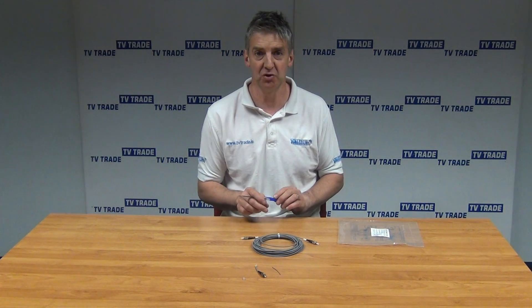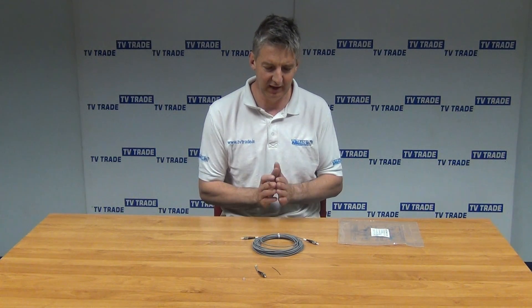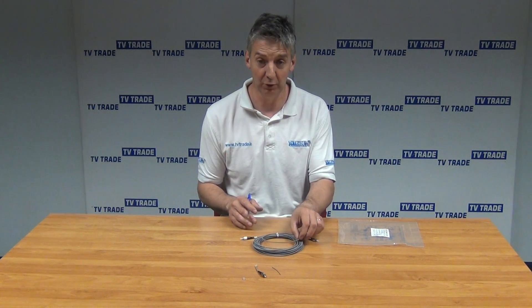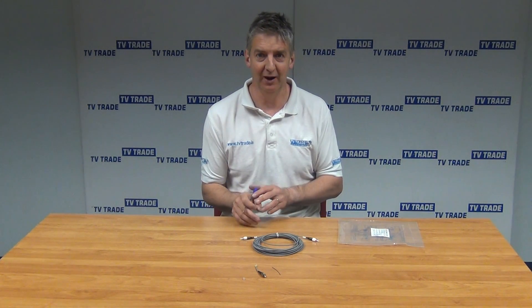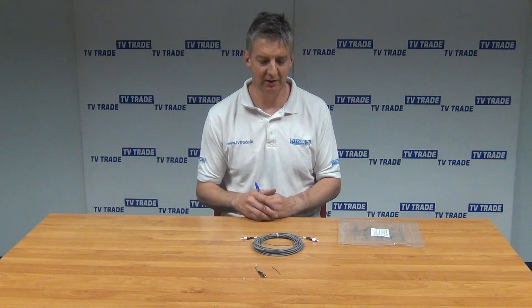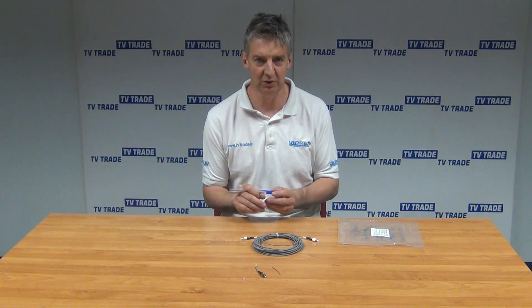The outer diameter of the cable is 3mm, and it's steel armoured in the centre of the cable to protect the fibre optic. It's LSZH, or low smoke zero halogen, outer coating. So it means that it's non-halogenated and it's flame-retardant. Basically, if there's a fire in a building it won't emit any smoke, and that's particularly important for use in industrial applications — it's often specified as a requirement. It's suitable for both internal and external use.